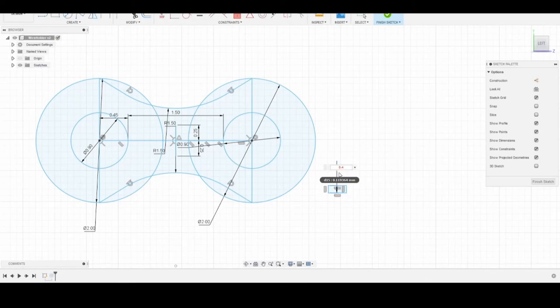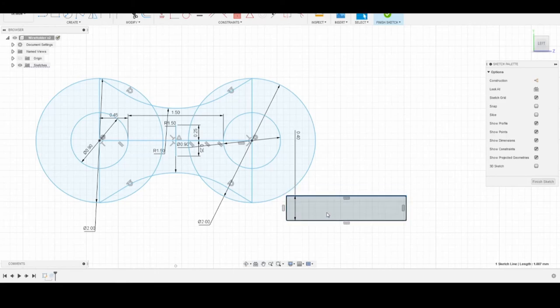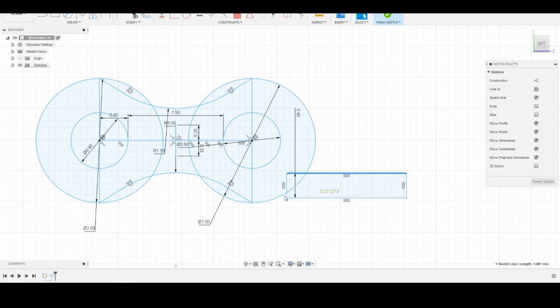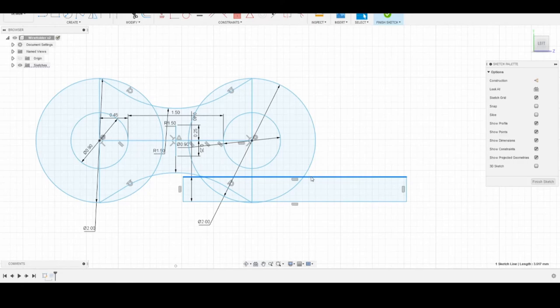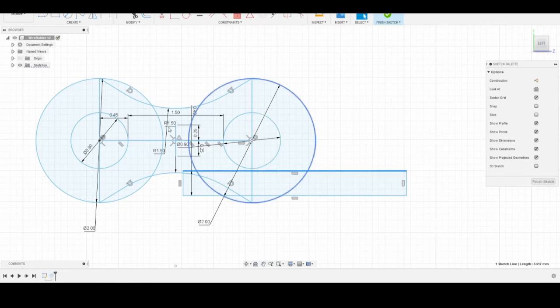And if I just do 0.4, you can see that this alone is 0.4 millimeters, right? Yeah, this is 0.4 millimeters, and this is as thick as each layer will be. Now imagine this along here. It's not going to work. This is less than two rounds around. It's just too little material for it to actually print properly, and that was a big problem. It just gave me a little blob, and it did nothing. It just gave up.